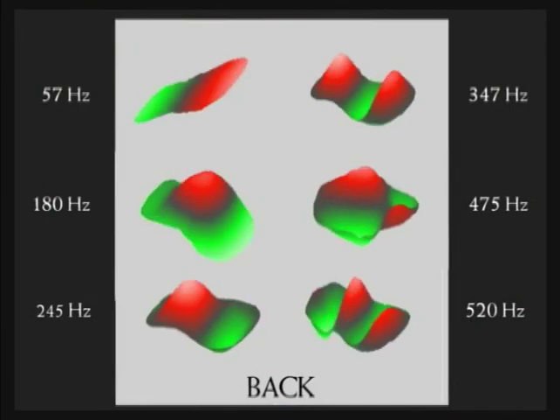The EQ on here, particularly the first stage, is designed similar to the expression system in that it's voiced specifically for acoustic instruments. When we first started designing the EQ, we wanted to find out where is that bass and treble that defines acoustic instruments — what we think of as the cavity or Helmholtz resonance. A lot of gear was not voiced with its knee or center in that range. That's why when you turn the bass knob up on a lot of devices, they're really boosting things that aren't naturally occurring on the instrument. This is voiced specifically for that.